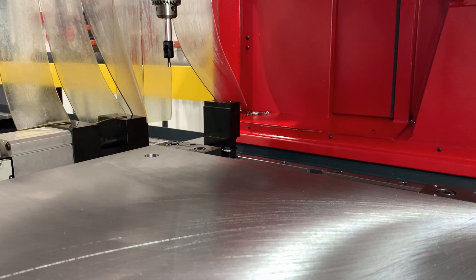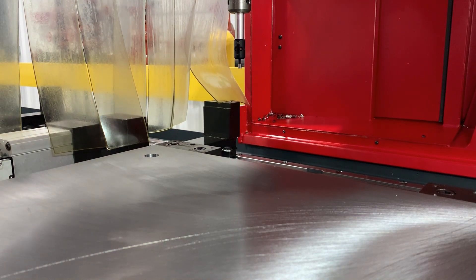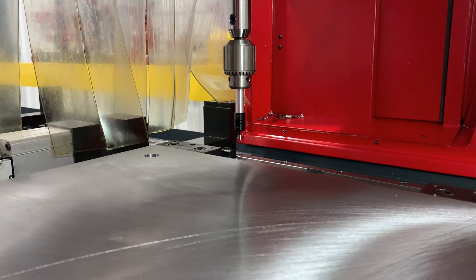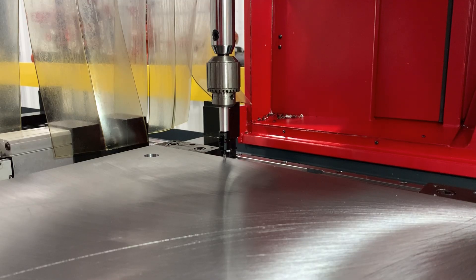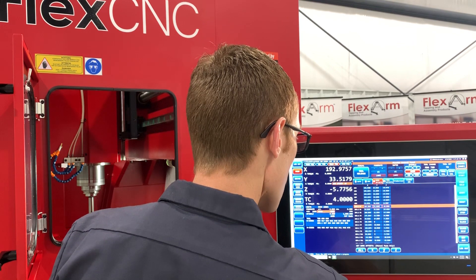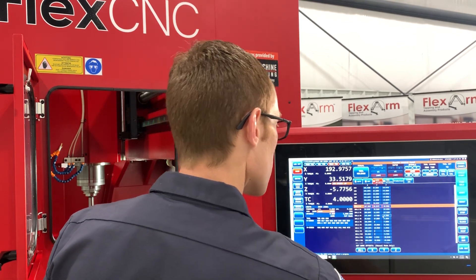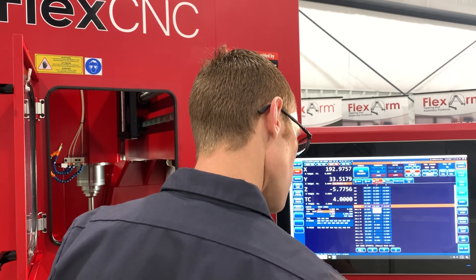Let's move X down and bring Z down. I'm coming around to the side of the machine to see it well. Moving one thou at a time, nice and slow, until we see that red LED. There's the light — on, off, on — we're touching right there. Going into the controller on Y, hit Y offset position. Again, we have to subtract the diameter of the edge finder — minus 0.1, enter.